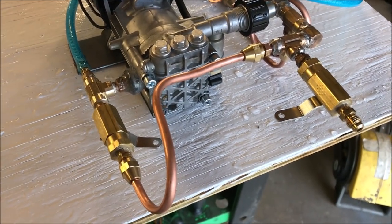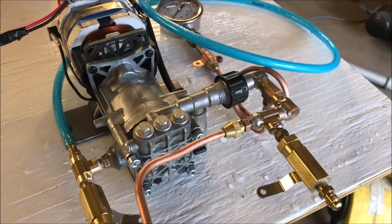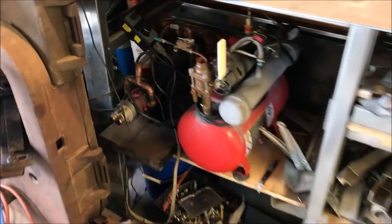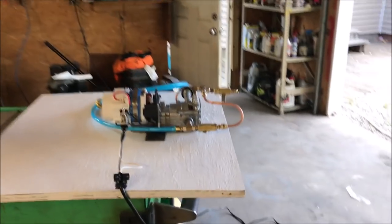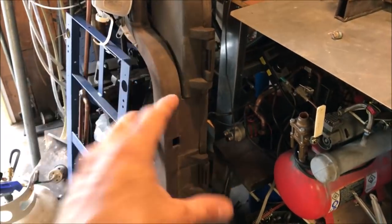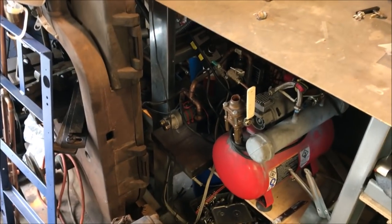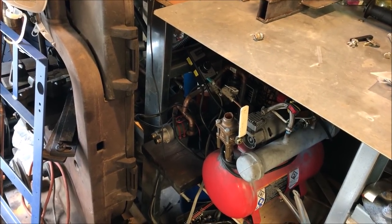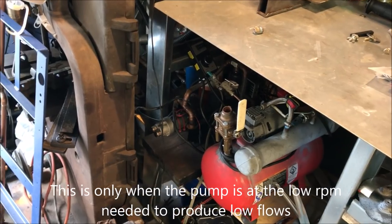One of the coolest things about this test is that I'll also be able to solve my oil pump problems I've had in the past. Building oil pumps for waste oil burners is very hard to do. This existing setup just doesn't do what you want — it's a very pulsey, gyration-type pump. The pulsations don't do well on waste oil burners because they translate into fireball pulsating. Every time the G-rotor lobes a clump of fluid into that line, it's like a machine gun. That frequency is very observable in the flame, and it creates what I consider unstable, less-hot combustion.